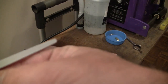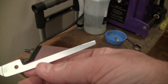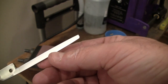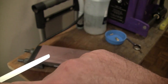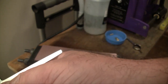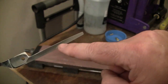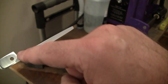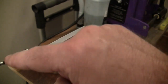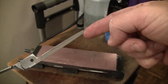I'm going to wipe these down and take a look at the ride line. I apologize for the video quality — it's never easy to shoot in light and get everything perfect. But we can see we do have a ride line all the way across the shear; there aren't any washed-out tips, and it looks good all the way around. You can also see this is double hollow ground — hollow ground here and also hollow ground along the length of the blade. That has to be done because the blade drops down so much before the cut that you have to readjust the hollow so it can touch on the flat stone all the way around the ride area and out to the tip.